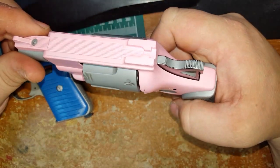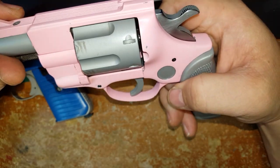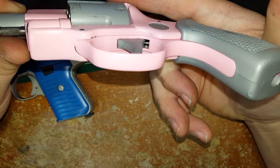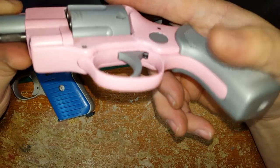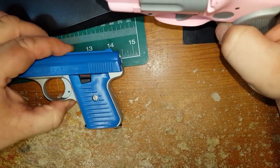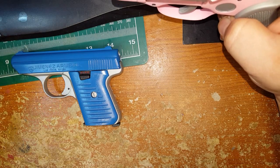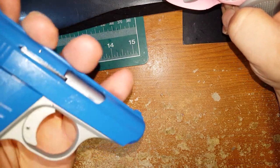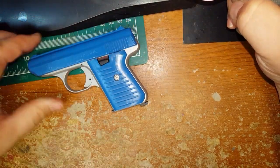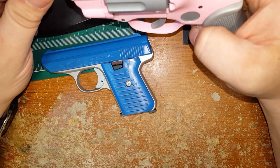The mechanical cleaning they say works — I might have just not done it as well as I should have, and that's probably the case. I'm sure there are guys out there that do it and it doesn't turn out horrible. This was one of my first jobs; I got this gun specifically for playing around with Dura coat, and it seems to actually be sticking pretty well on this little gun.